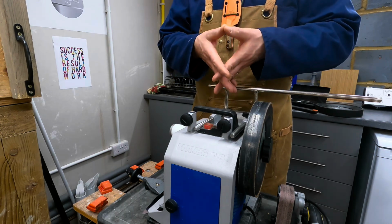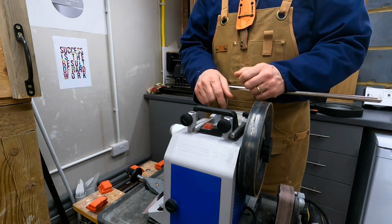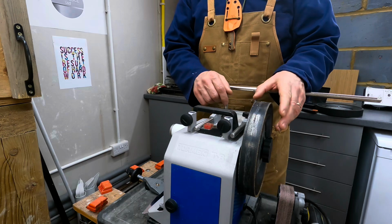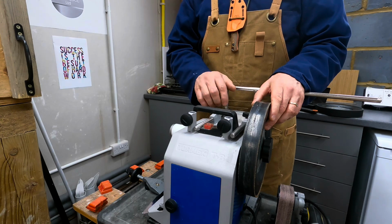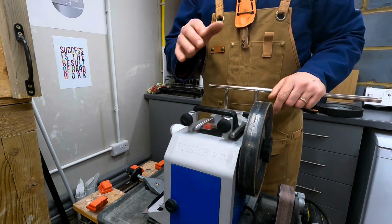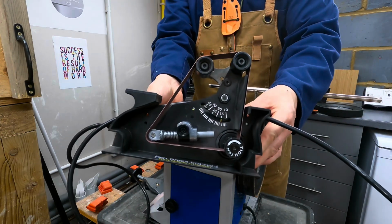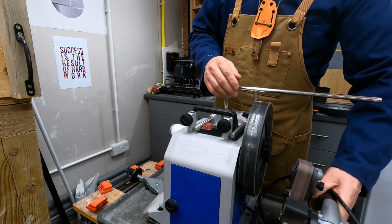So honing is the process where we clean all that metal up so that you end up with a nice, sharp, clean point at the apex of your knife. And not only is that going to give you a sharper result, but more importantly, a longer lasting sharpness as well. I have two sharpening systems that I primarily use in my workshop. Tormek features a lot. It's probably my preferred system, although a close second would be the WorkSharp Ken Onion Elite, another powered controlled angle system where you can set exactly your angle, and both of them have honing capabilities.